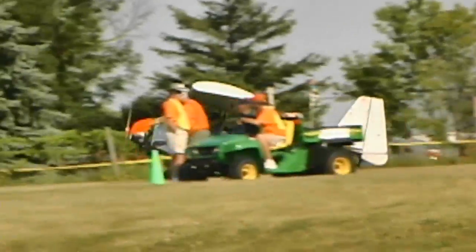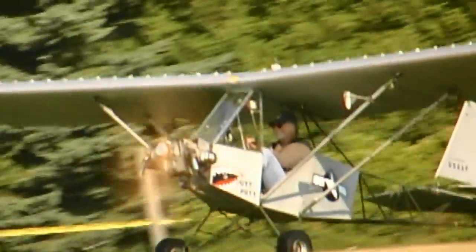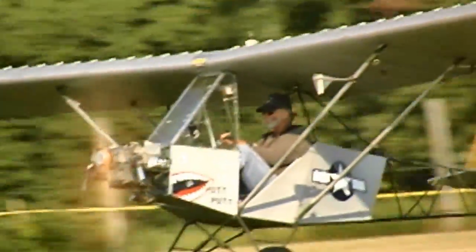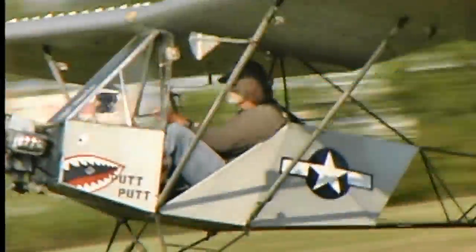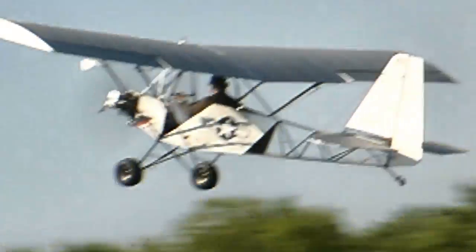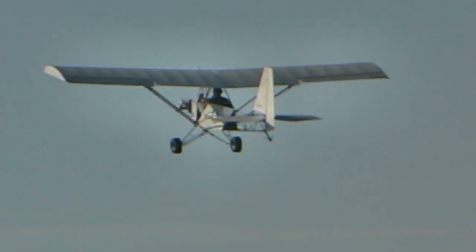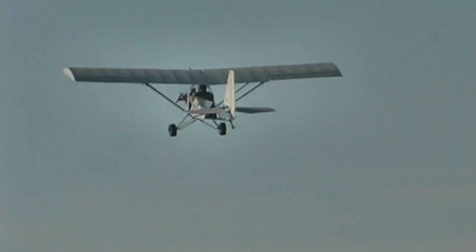And they hang right on the back of the head, and there's no chance for them to ever ice up hanging back there on the back of a hot head. But this little carburetor here could possibly ice up on you. And so I don't sell plans to something like that if I can help it. But this engine runs great and does a good job for this airplane, and I just hate to make any changes on it because it's doing so good like it is.